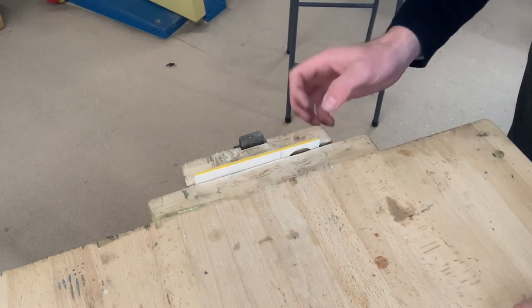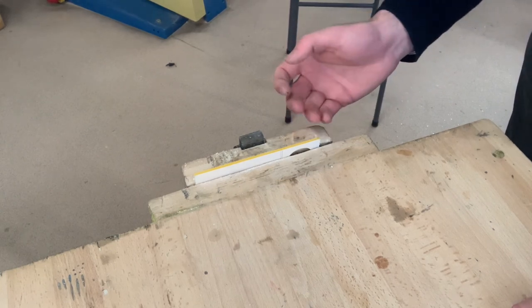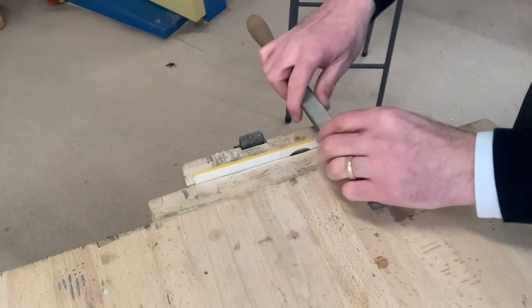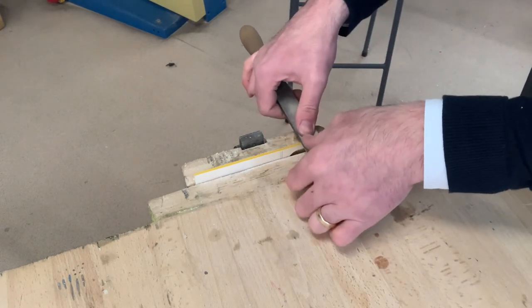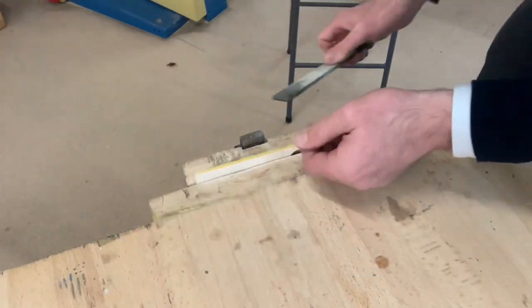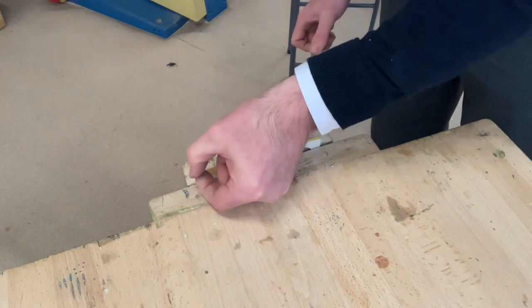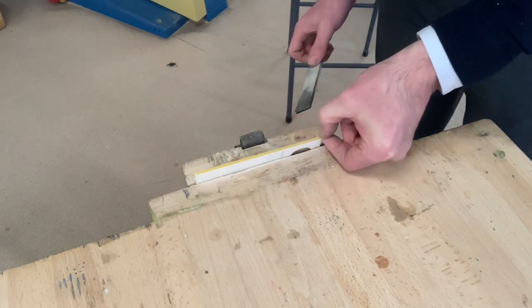So remember as well, don't tighten the vise up too tight, okay? Because like I said, acrylic is very brittle and you don't want to snap it. So again, thumbs in the middle, over the top of your acrylic, and back and forth. And just to check on your work, run your nail across the top. And if you feel there's still some saw marks in, then continue.